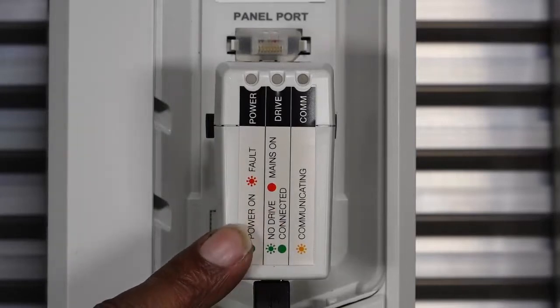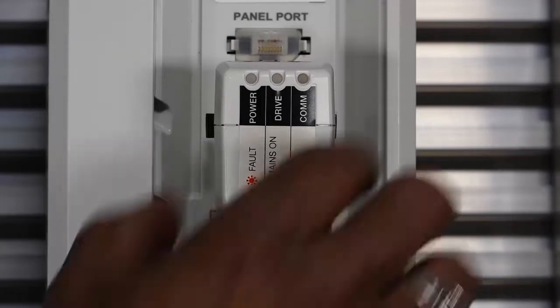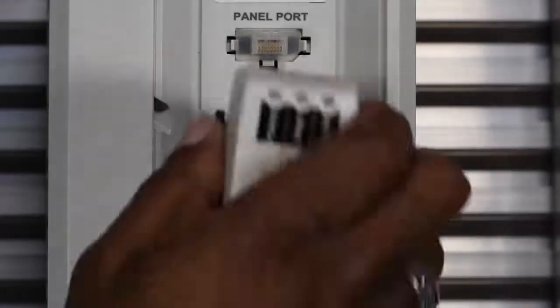The power light: if the power light is off, you are not powered. If it is green, it is powered successfully from the USB. And if it's blinking red, it's in a fault state. My suggestion if you ever get into the fault state is to disconnect the device and the USB connectors and reconnect.